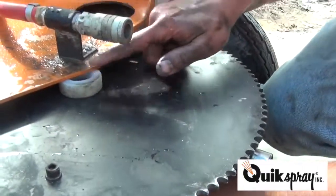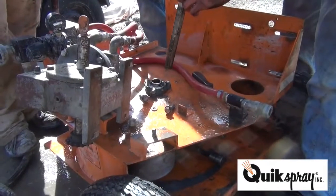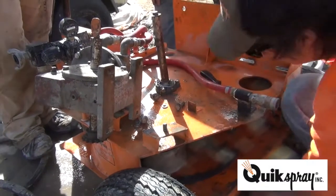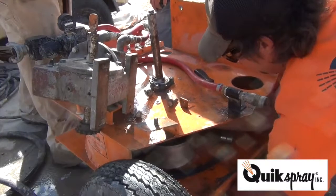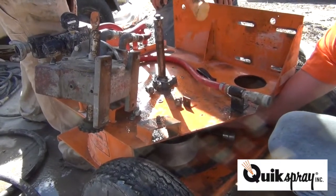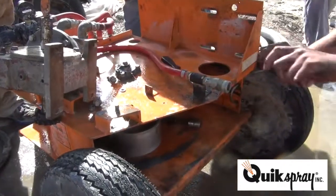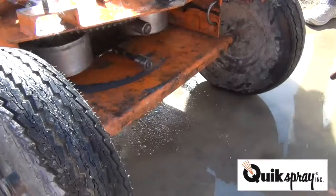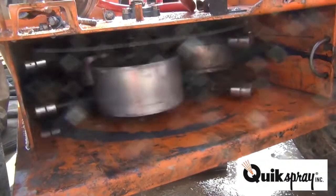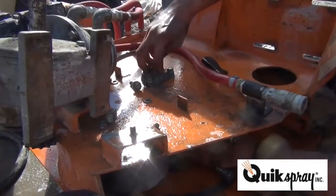See how, right now, how tight it's fitting on the top of the housing? That's what we want. You can hit that point, push it through it. Always leave a little bit of gap right up there. And now that the guts have been properly shimmed, these are not touching, and it runs smooth. You don't hear any grinding. Nice. So now we can go ahead and get the center bolt tight. The reason you leave a little gap up here is so you can see the flat.